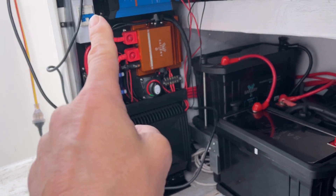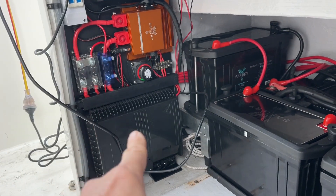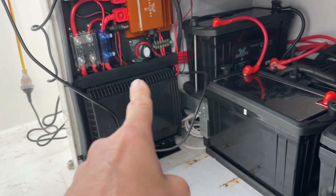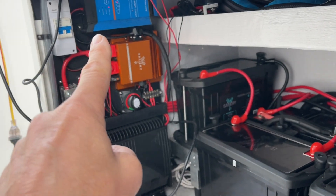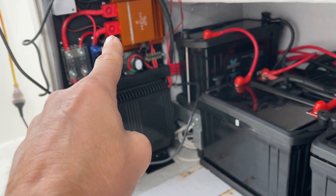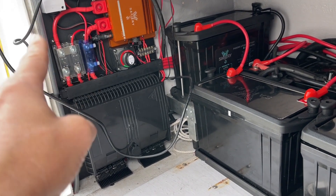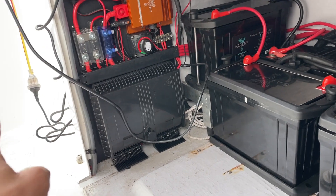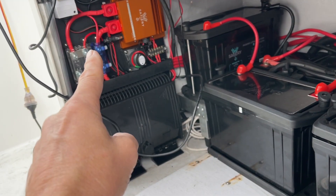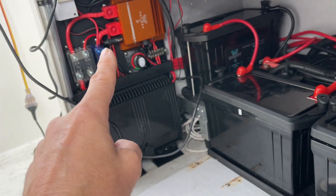We've got a solar breaker up there, and underneath here is a fully enclosed box — which I'm going to open in a minute — where we build our smarts for our hub. There's a 240 volt AC charger at the top. Scotty here is currently charging off the AC charger, coming in on the 12 volt side. When he's out at sea and that's unplugged, the outboard engines come into Scotty and charge the 36 volt.